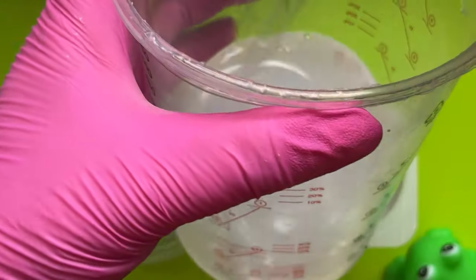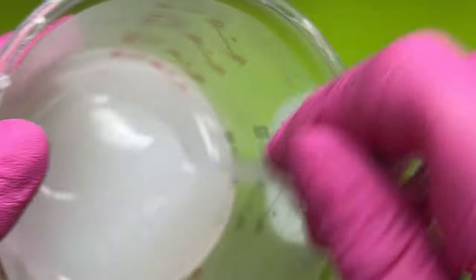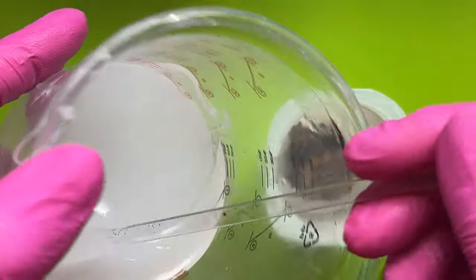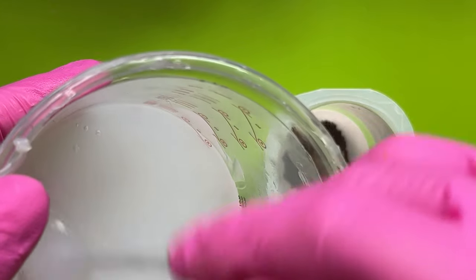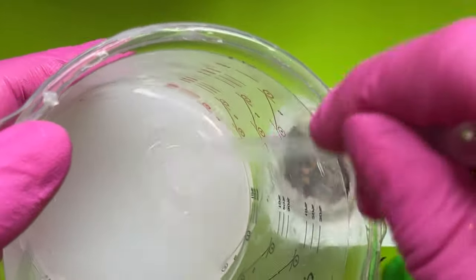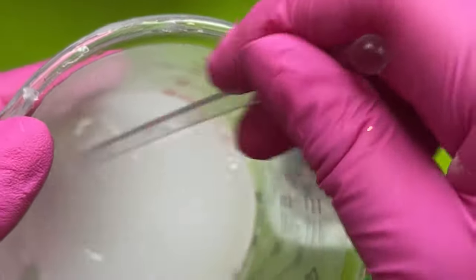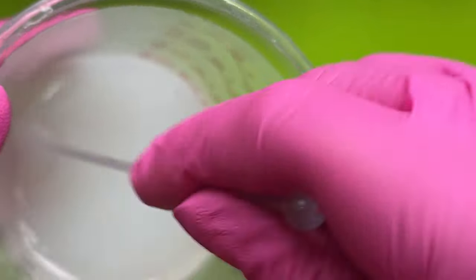Okay, so I'm mixing up the silicone — there's 100 millilitres there, just slightly over. It's a one-to-one silicone which makes life nice and easy. It dries kind of semi-translucent — if you're making small and thin molds, ultraviolet light will pass through it, therefore it's really good for making molds with if you're going to be using UV curing resin. It cures nice and soft, seems durable, stretches quite nicely as well. Things that are difficult to get out of molds — as I have a sneaky feeling this little dragon is going to be — it's really good silicone.